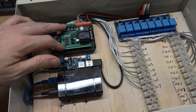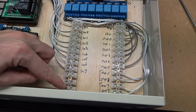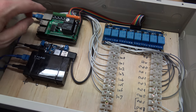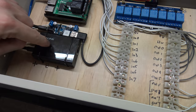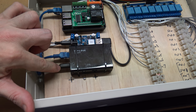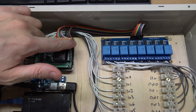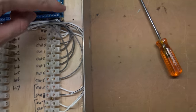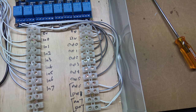I've got the Raspberry Pi and the PiFace relay board for the outputs. For the inputs I've got connector blocks, and output connectors to make it easier rather than dealing with the tiny connectors. The PoE comes from the switch — network and power into the PoE splitter. The network goes out to the Raspberry Pi and the DC output is 12 volts, going to the 12-to-5 volt converter to feed the Raspberry Pi. I'm also grabbing from the 12-volt side to bring power around to the other side of the board for the motion sensors and sirens.